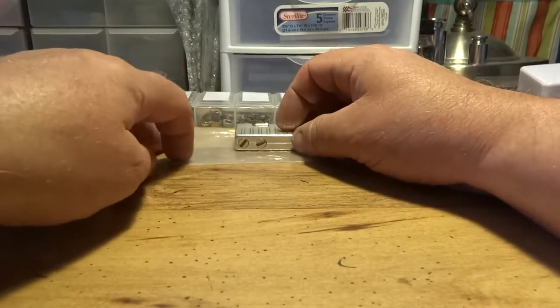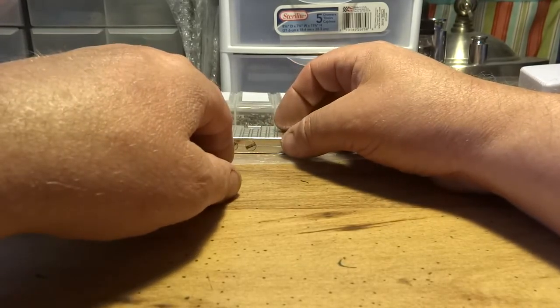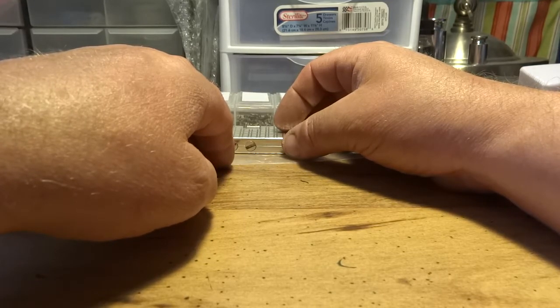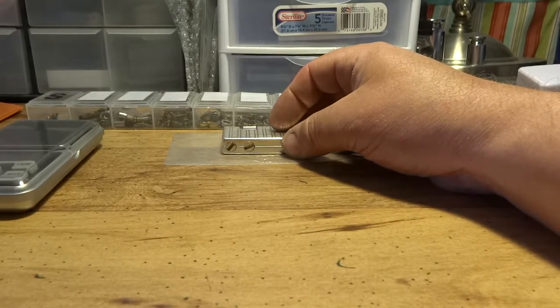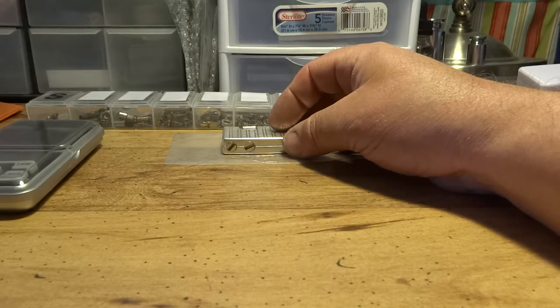The Zema lighters I've been rebuilding — I'd call them a good quality lighter, good Japanese engineering. What I like about them is that when you take one apart, the stopper is maybe 2 millimeters by 1.5 millimeters, and the design of the lighter doesn't really contribute to getting a lot of heat down there at the stopper. So you can probably let those run five, six, seven minutes or even more, but I still don't recommend it.